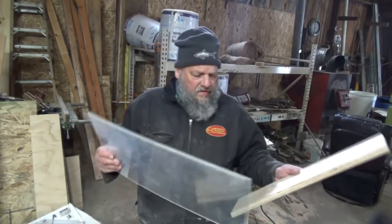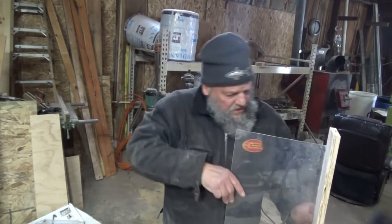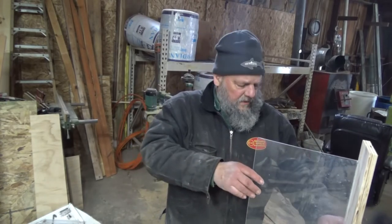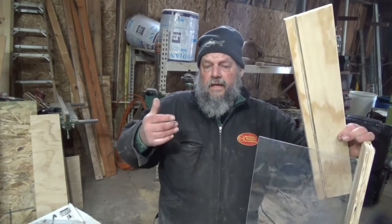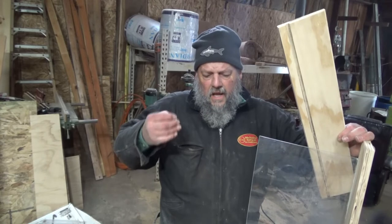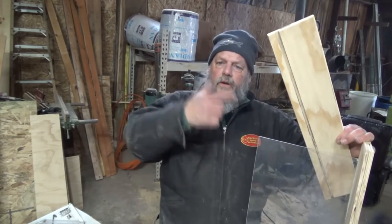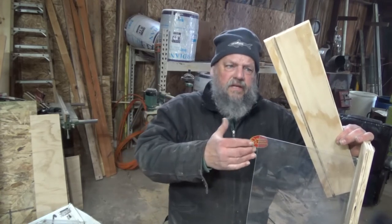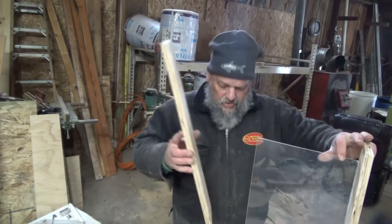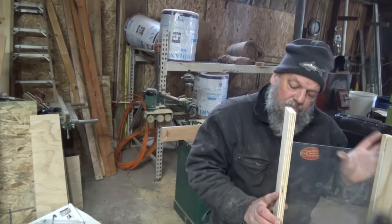I intentionally made that a loose-fitting joint, primarily because I'm using an older piece of plastic and it's got a bit of a bend to it. But I also wanted to make it a loose-fitting joint because I'm going to put silicone down into that joint all the way around. And I want the silicone to not just be on the outside, I want it to actually be in the joint. So now I'm just putting these two together, the two side pieces,